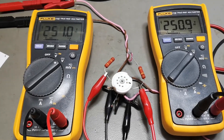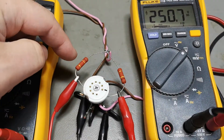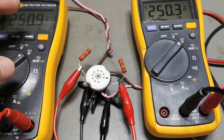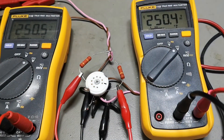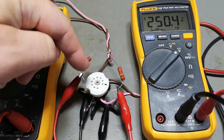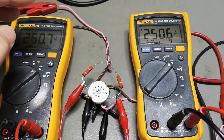On the anodes, the 100k resistors — I use two or three watt resistors; one watt is probably enough. What you want is to be able to handle if there is a short in your tubes, because you're testing old tubes and there could be all sorts of shorts. So you want to use resistors that can handle the short, and you also want to use a regulated DC for the anode supply.